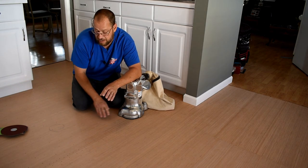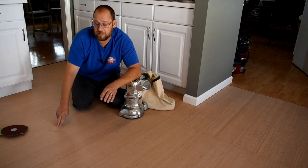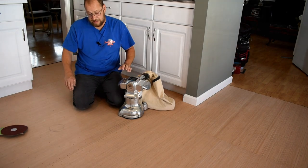I will be hitting those circled staples with my sander. I don't want to pound them in for fear of leaving dents in the floor, so I always want to sand them off. Anyway, let's get right to the sanding.